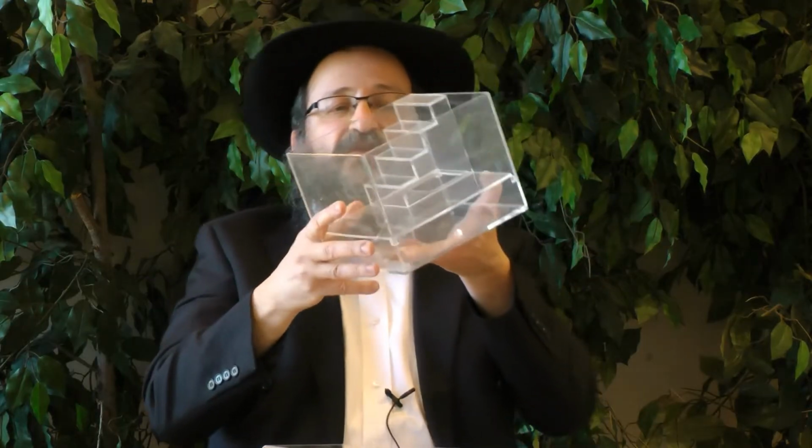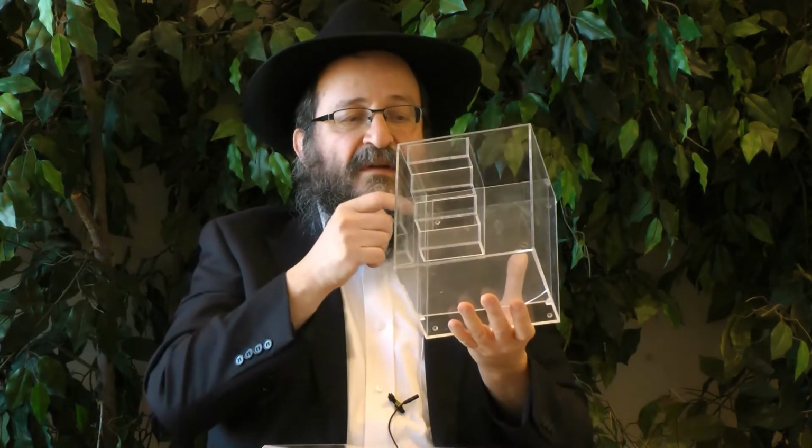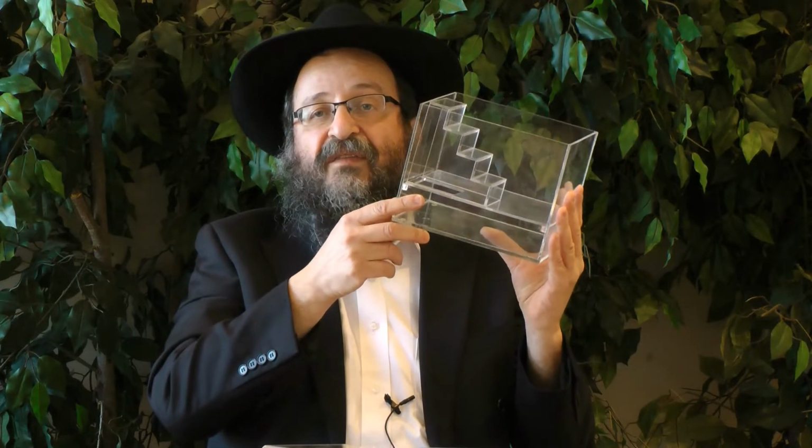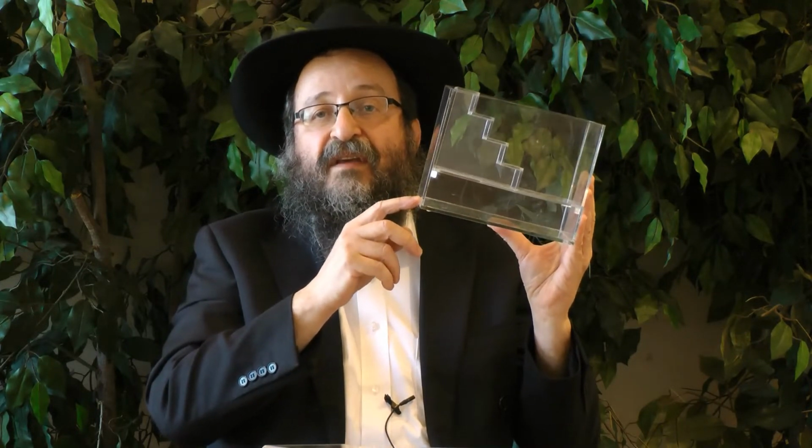You'll go down with the trap door, and you'll have to take apart all the wood, nails, and everything that's in there. Advisable, when you make that platform, make it with a lot of small pieces, because if you put one big plywood, it'll be very hard to rip off. But if it's a lot of small pieces, once you get the crowbar in, you'll be able to remove them much easier.